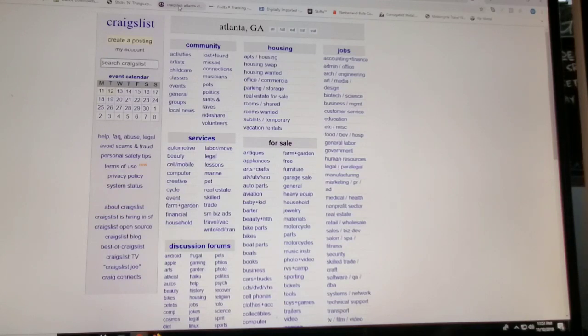You don't buy new, you buy used, because you can buy used stuff that's, look, an amplifier, a power amp especially, a solid state power amp even more especially, it doesn't have any moving parts. It just sits there and amplifies, okay? For the most part, the only thing that ever goes wrong with those, if they're in good condition and not blown up, is that you may need to change the electrolytic caps, which is very simple. You don't necessarily need to do it yourself.